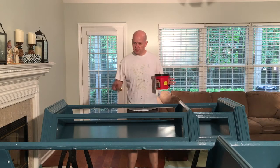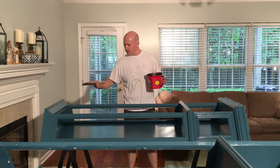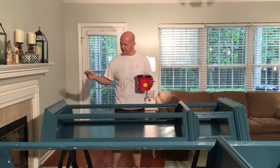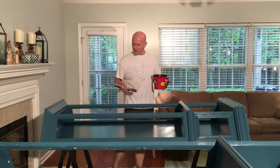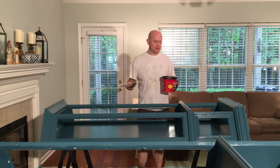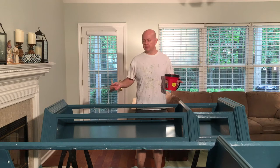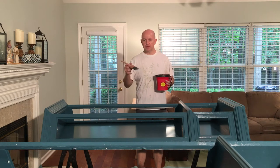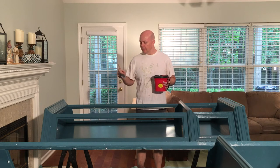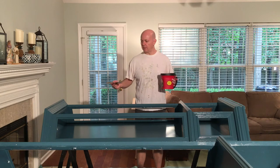We have put our first coat on the curios and it is dry. With the new paints, it is very tempting because it covered very well to leave it and say you don't need another coat. But especially with high gloss and semi-gloss, you really need the second coat to actually bring out that finish in the paint.